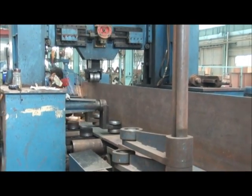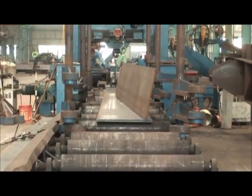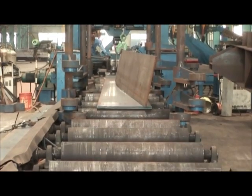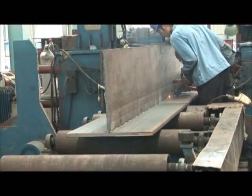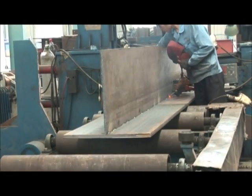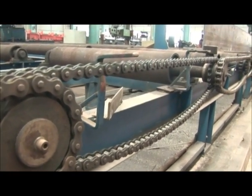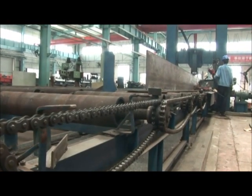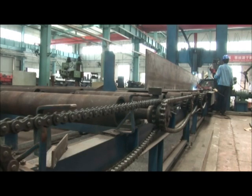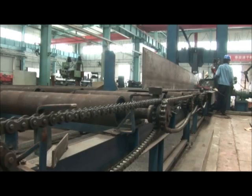HGS Series H-Beam Heavy Type Automatic Spot Welding Assembly Machine adopts international universal technology — One Side Mechanical Location and One Side Hydraulic Compaction. It can accomplish assembly and auto-spot welding of ultra-large H-Beam steel automatically. The 90 degree hydraulic turning over frame is inside of the H-Beam assembly machine's transmitting roller and it can accomplish 90 degree turning over of T-Beam or H-Beam by synchronization control.